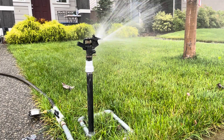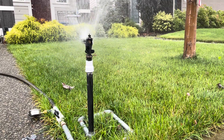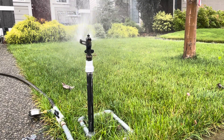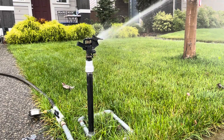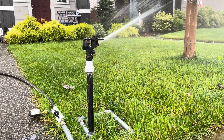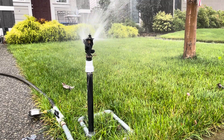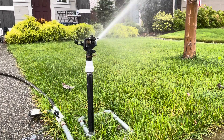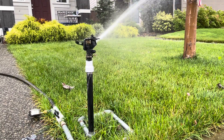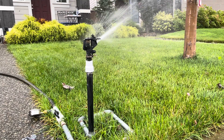I find it interesting — when this sprinkler is running, there's only about 20 pounds of pressure. As soon as I turn the water off with the faucet or with the valve that I have here, it goes up to about 50 or 55 pounds of pressure. And as you can see, I have a new standpipe. I changed the elbow down there from a half inch to three-quarter, and so I have three-quarter going all the way around until I get to the riser.